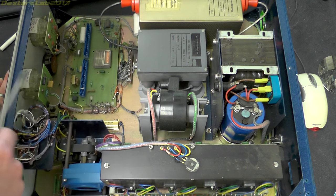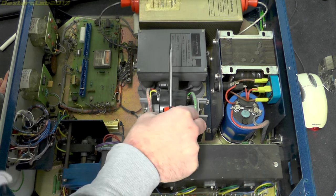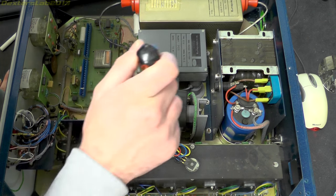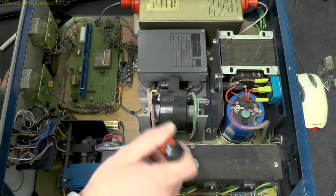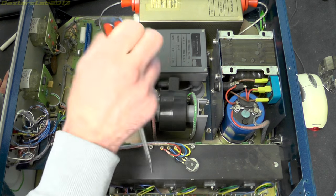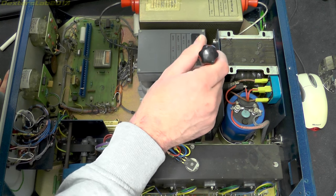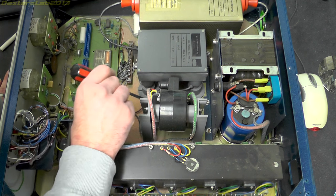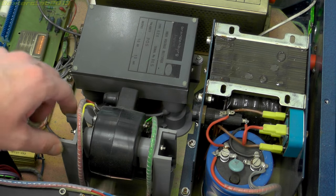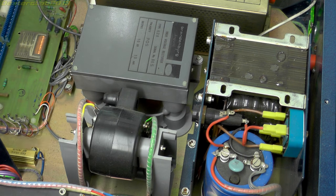If we take a closer look at some of the more interesting parts - the three high voltage bits. We can see the ferrite core. There's another device and a high voltage connection coming out of the flyback just here - it runs down into a small box I can't quite see underneath, then comes out and goes into this rectifier here. So this might be some kind of output for feedback. I can't get this out without flipping the whole thing over, so I'm just going to take off this rectifier which looks like it's just screwed in.